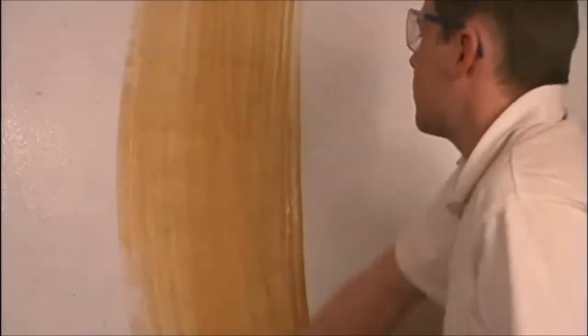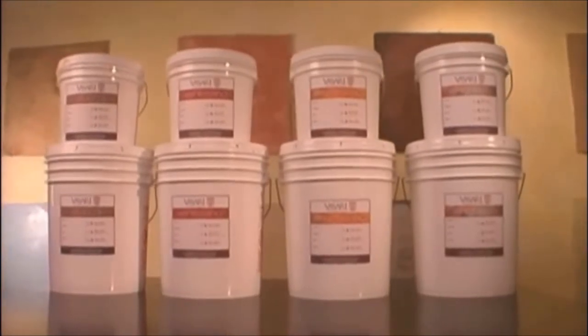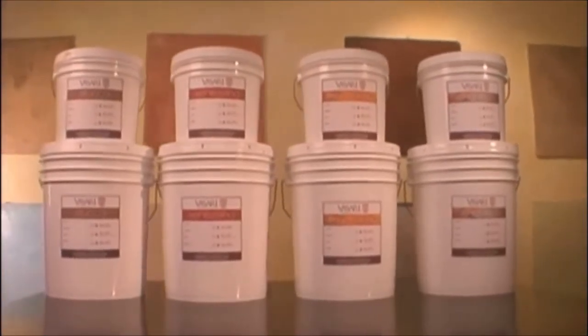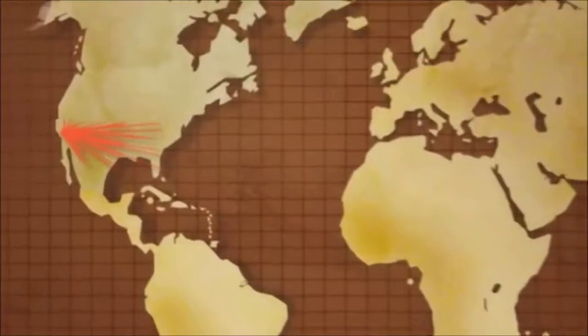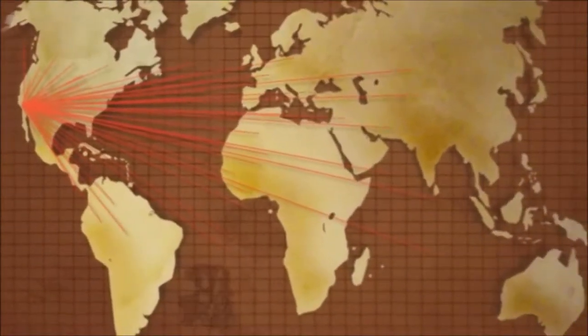Dry mixes are excellent when lime washing white Marmorino or stucco instead of tinting the plaster. One coat of lime wash will reveal some white background and 2 or more coats will make a more solid color. Sealed in airtight plastic pails, dry mixes are resistant to frost and have an indefinite shelf life. Also, being lighter, they make shipping much more affordable.